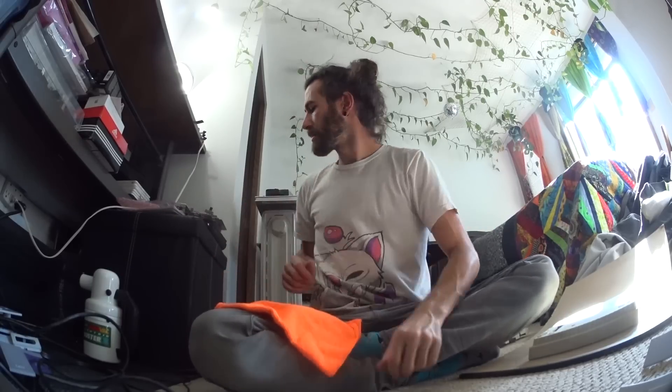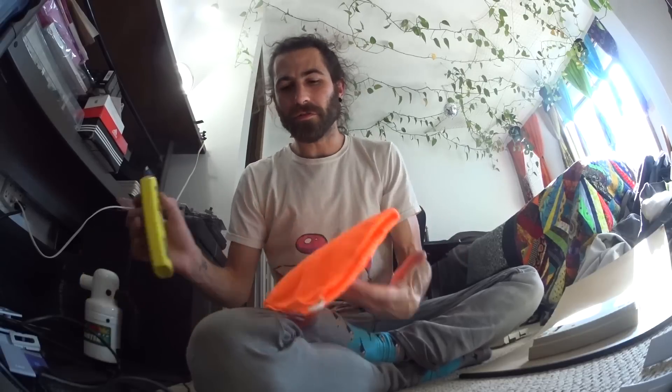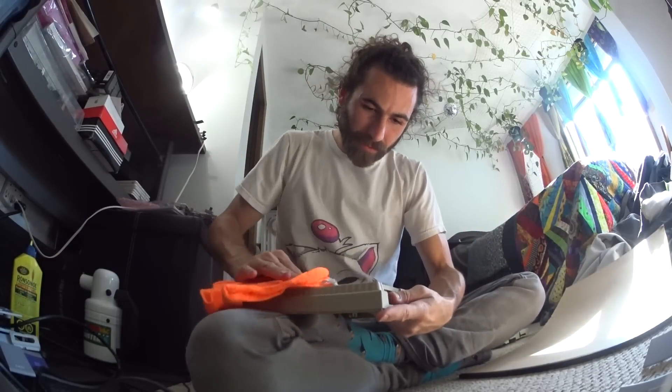The one final step before prep is complete - and I'm so glad we're there because this is the most time-consuming prep - is to take a soft cloth and wipe it down with some naphtha, which is lighter fluid. This is called degreaser when you use it in automotive shops, but it's all the same stuff. It's a really good choice because it dries really quickly, it emulsifies any sort of greasy residue, and it doesn't leave any residue.